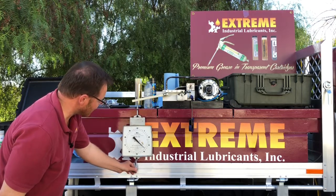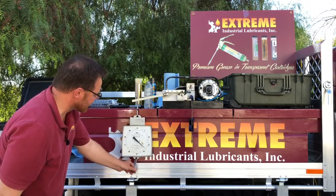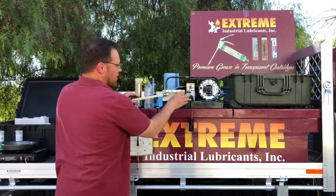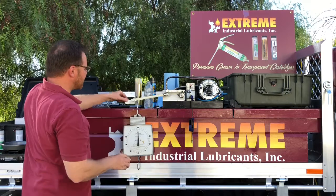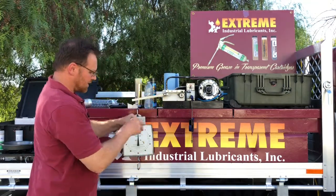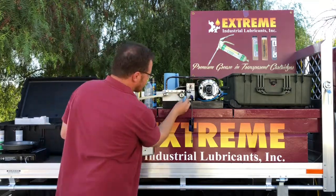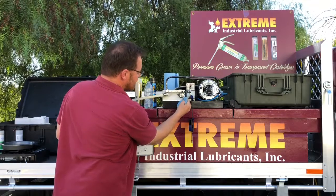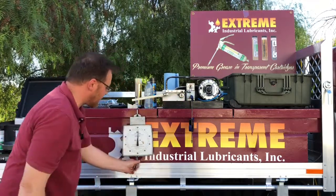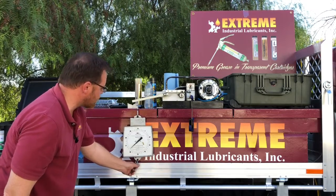Three, four — and just a reminder, the lithium grease with no water went to one pound. So our grease is very water resistant and extreme pressure resistant. And if you forget to grease the equipment, your bearings are still protected. We're going to see that by simulating forgetting to grease — wiping it off — and you can see that our grease is already in the pores of that race, so you can still put extreme pressure on it even after wiping it off.